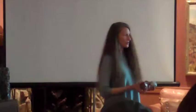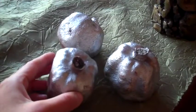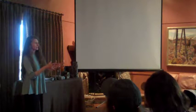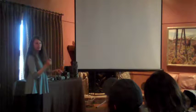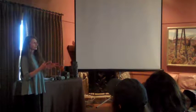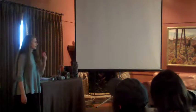As an example — don't mind the silver spray paint, that was my daughter's doing — these are actual pomegranates. I did what's called direct casting with these. With those, it was a really interesting direct casting because I could use the thing itself since it's going to burn up. So I dipped it in wax and then did what's called spruing it, which you will see in this video. These were cast in what's called ceramic shell. You can also do a sand mold — that big indentation in sand in your book is actually a piece I did in a sand mold at an iron pour.